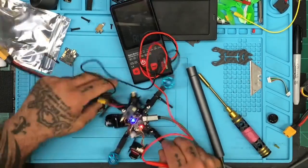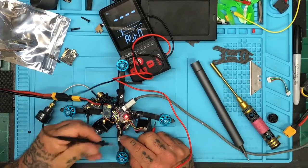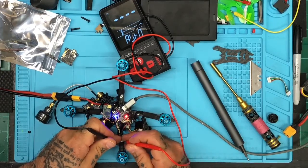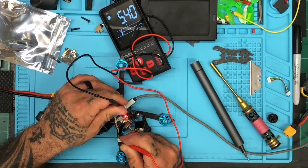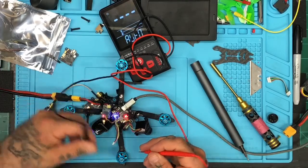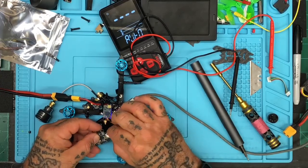All right, I just gotta put this down somewhere so I can function, okay? So let's put this on the table here. And I'm just gonna take it from the plug, all right? So here's the plug, and this should be the 5-volt pin, and then I'm just going to come over to any ground. Okay, so I'm getting a 5.4 on this. Which is kind of odd because the board is not reading as it's getting 5.4. So why? Let me see. Let me put this back in.